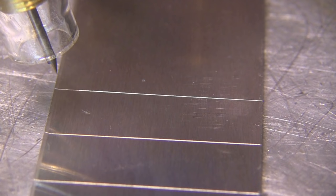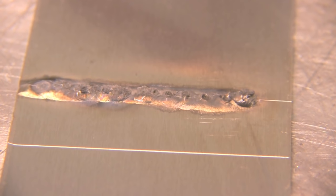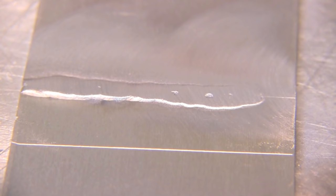I'm going to run a bead here using that sharpened electrode and DCEN with straight argon on aluminum. And you can see it's just not working out all that well. I've got it slowed down and you can see I'm trying to punch through a scummy film on the surface — it is looking like Fido's butt. A quick polish reveals all kinds of little holes and porosities in there.